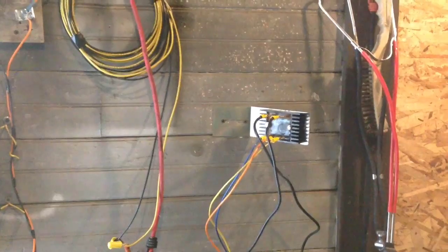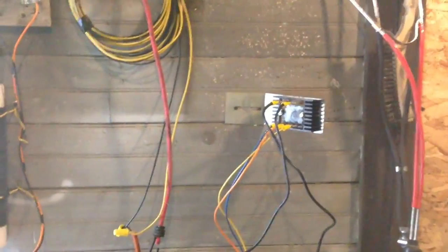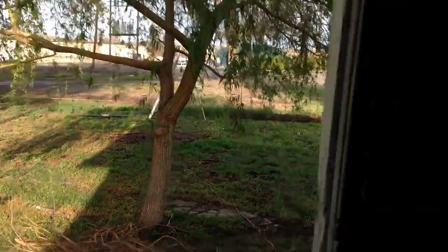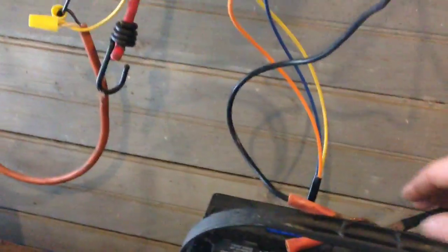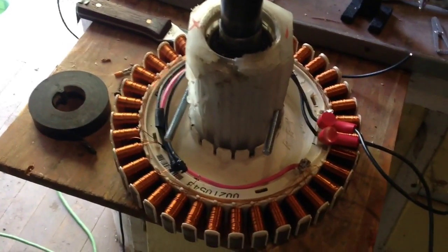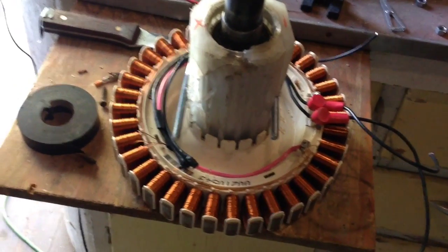It's been about two days since I posted that last video about the horizontal axis wind turbine. My update so far is I've run three phase AC all the way from the turbine out there by the ladder, and I brought the bridge rectifier inside, and I have my DC coming out, which I put two alligator clips on so I can connect it to a load. We had about six to eight mile an hour winds today, and open circuit voltage was around 70 volts with the stator wired back to factory, which I believe is capable of producing around 400 volts maximum.